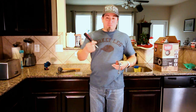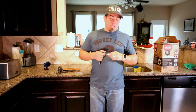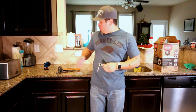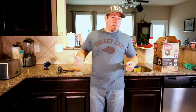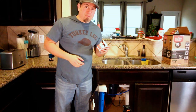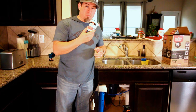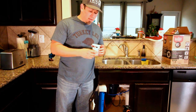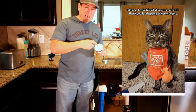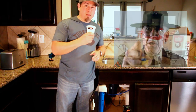You'll also need a Phillips head and a flathead screwdriver. I'm going to use a socket and a ratchet because there are two bolts to pull out of the side of the garbage disposal — you could use pliers if you don't have a ratchet. I almost forgot: you're going to need some plumber's putty. This is important or your sink is going to leak. When you buy it, make sure the top doesn't have a crack in it, because then you've got to take it back to the store. Plumber's putty.